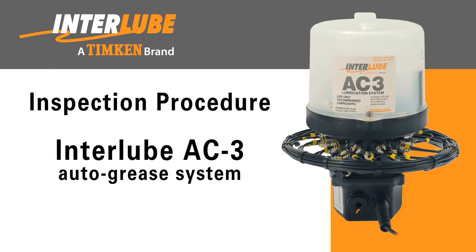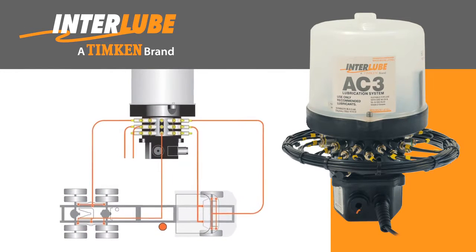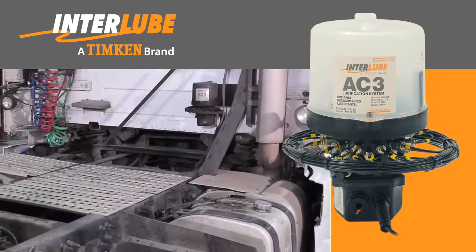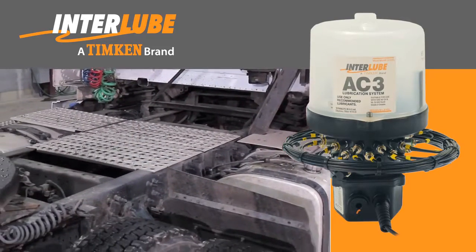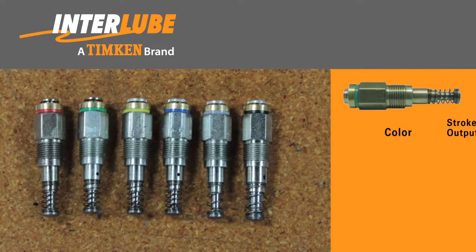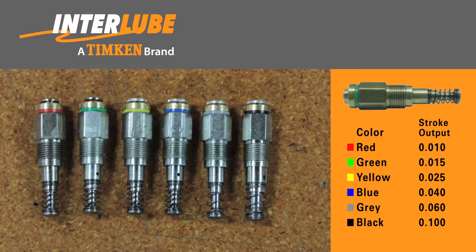This video training is designed to review the proper steps for inspecting and maintaining an Interlube AC3 chassis lubrication system. A typical multi-line auto grease system on a tractor unit has 24 separate lube lines going from the pumping elements to the 24 different lube points on the chassis. There are 6 different pumping element sizes available, depending on the grease volume needed for a particular chassis position.